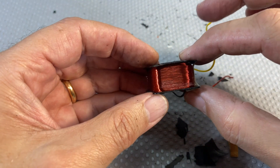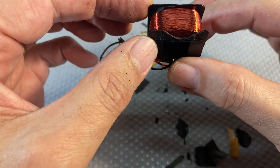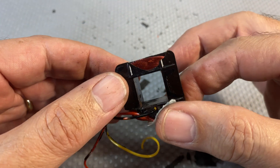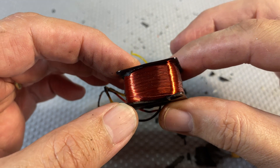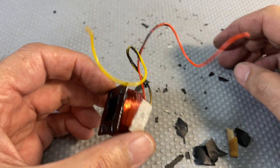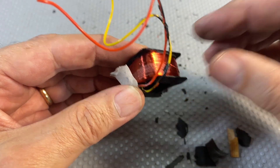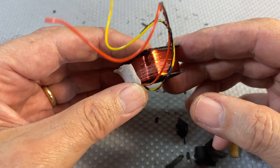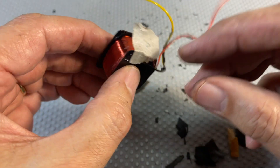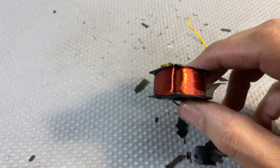There's obviously some kind of break on here. The wind is blowing — we've got a storm going. I don't understand why it would give us 10k, because the windings — if you have a short you'd get less resistance. I can't understand how a break would give you that lower resistance. So there might be some sort of carbon residue where this thing opened, and that carbon is acting as a resistor, therefore it's alternating between 4 and 10k.